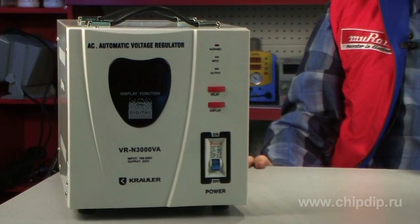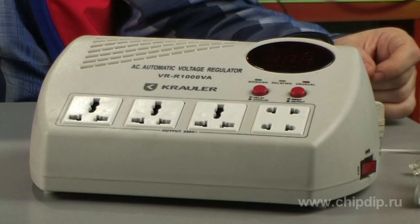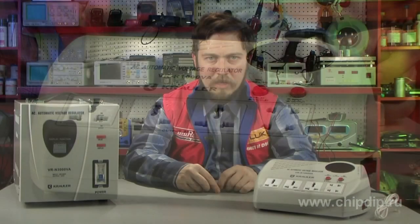The overall advantages of relay-type voltage stabilizers are as follows. First, high stabilization accuracy, directly proportional to the number of steps. Second, no distortion of the voltage shape, since distorting elements are absent. Third, a wide working temperature range. Fourth, high noise immunity, since the relay is not affected by noise in voltage or current waveforms. Fifth, low sensitivity to network frequency. And finally, low price.